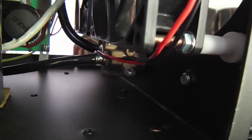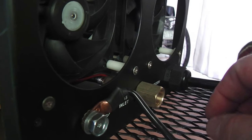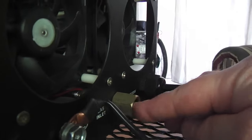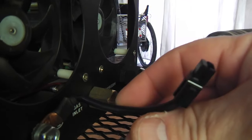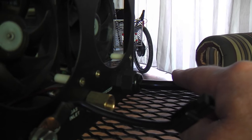There's the solenoid down there for the gas. On the earlier edition of this unit, they did have the quick release fitting back here, and this one isn't — it's a screw-on. I have a fitting that will go in that, and also some quick fittings coming — just much like a compressor quick connect. I've got the high-frequency ground pigtail put on here. I'll put a pigtail for this, and I'm going to be doing something with the power cord too — maybe a pigtail so I can just disconnect it and take it out for stick welding and then plug it back in.